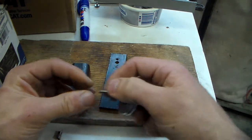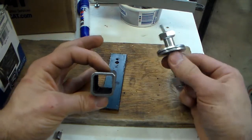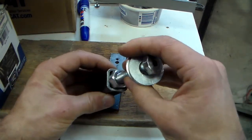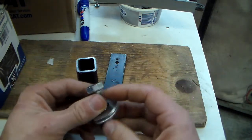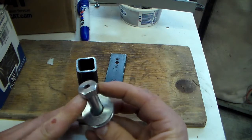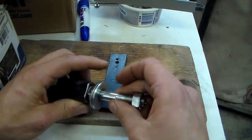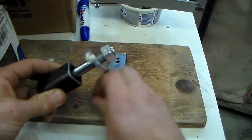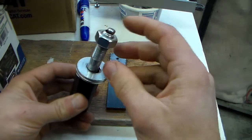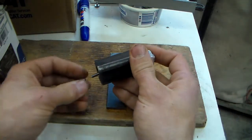This is what's going to pull the rivnut once it's in place. And I found this piece of square tubing that's almost the right size. I had to take off two corners of the head of the hex bolt so that it would fit inside there, so that it would slide in and out but not turn, so that when I'm installing I drop the bolt in like this, push it all the way out and then find the rivnut.